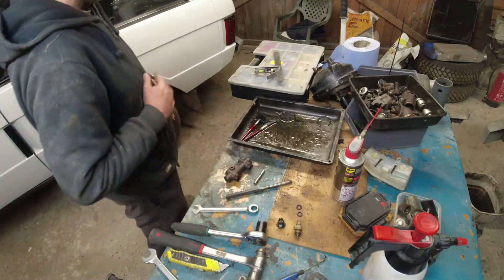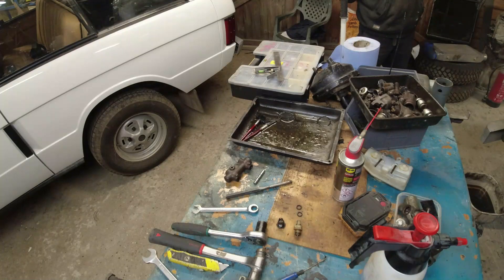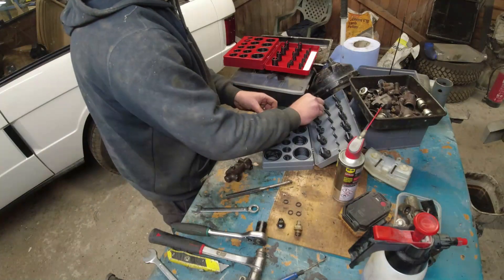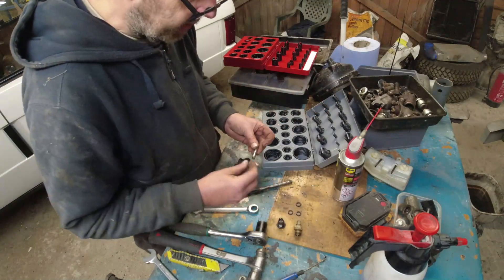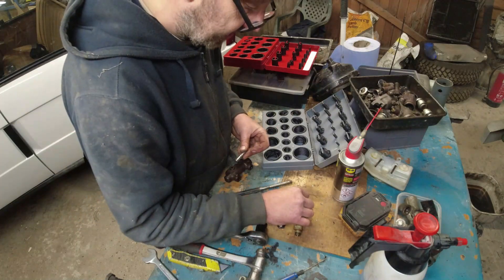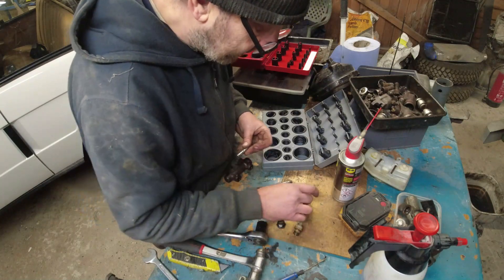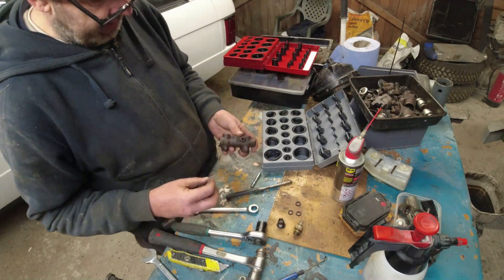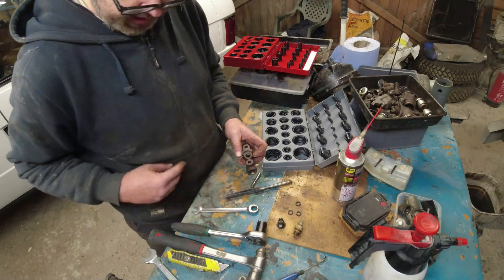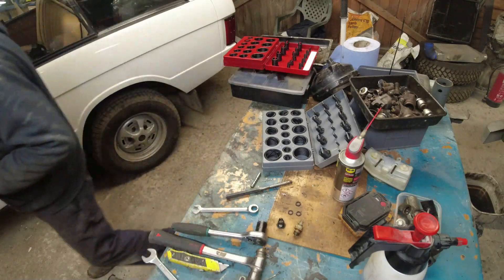If the pressure won't hold - once it's sat in place it doesn't move, it's not running against those O-rings all the time. That was loose, no good. So I'll go with these two because they're roughly the same outside diameter, give or take a quarter of a millimeter. When the shaft is on the inside they'll fit beautifully. Now getting this thing back in here again is going to be a struggle.